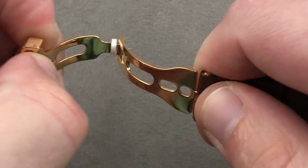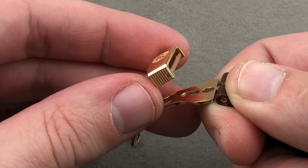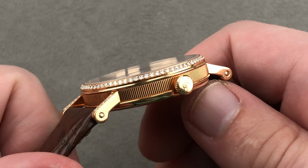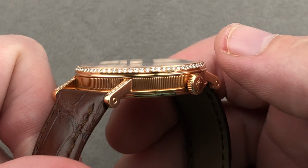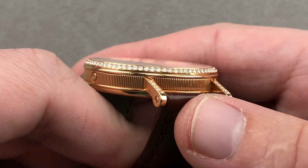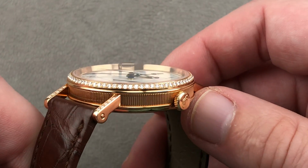We pop this open so you can inspect, and you can see that it is internally polished and it features coining on its flanks for easier gripping, but also to mirror the coined flanks of the case, which are cold rolled and then finished by hand to create the clean coining with the boundaries between the lip of the bezel and the case back that you see here. The lugs are welded on by hand, which is old school manual case manufacture, and a wonderful artisanal throwback in the fabrication of this watch.